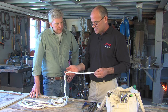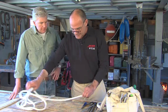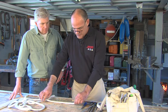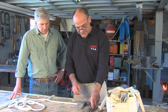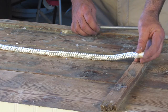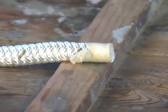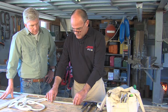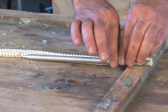This particular one is a half-inch nylon, very commonly used as a dock line. To start, you want to make sure that you have a clean cut end, not a melted one — which we do. With a half-inch line, we'll be using a half-inch fid. You've already taken a few wraps with the masking tape around it to keep it from unraveling — that is correct. To start, from the end of the line, we will come in one full fid and just make a mark.